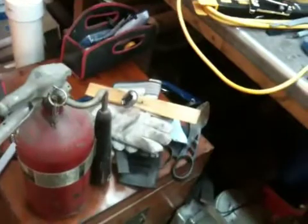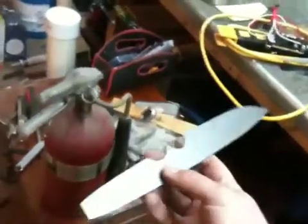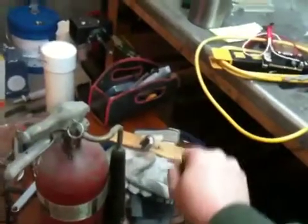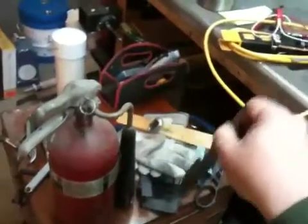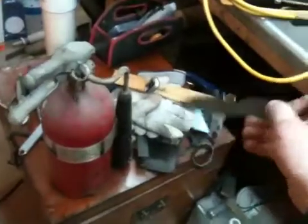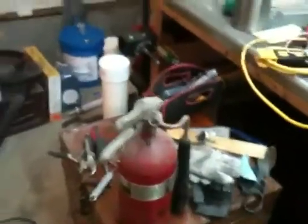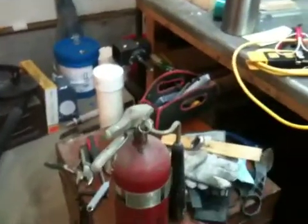Things were pretty much uneventful, which I'm happy to say. There were no flashes or flare-ups, no fires of any kind. I'll use my template as an example of what I did. I pulled the blade directly out of the oven, plunged it in tip first, and then agitated it back and forth from spine to edge. You never want to go the other way, as you could cause uneven cooling and your blades will tend to warp or twist a lot more easily. But the blade came out as straight as it did going in — no warping, twisting, or cracking of any kind. Very happy to report that.